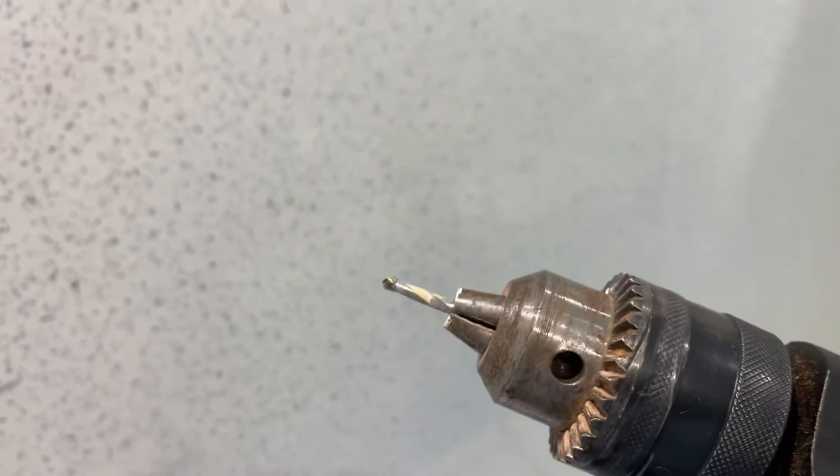So all we are going to do is drill the holes, and for that we have got the trusted Black & Decker. We are just going to put in our little pilot hole first of all with a 7mm bit, put some Plas plugs in and then hopefully we will be good to go.